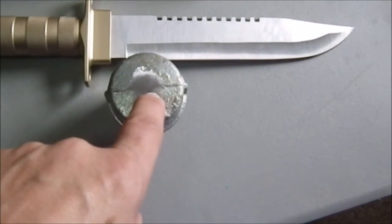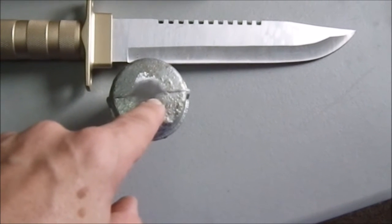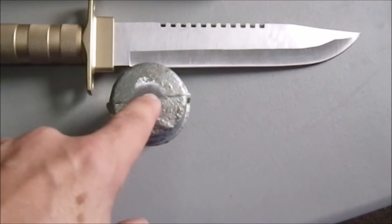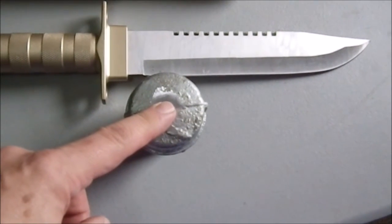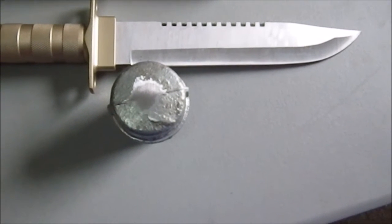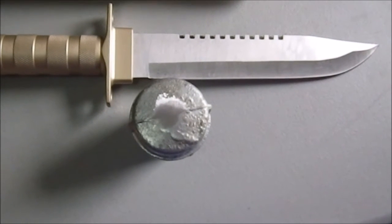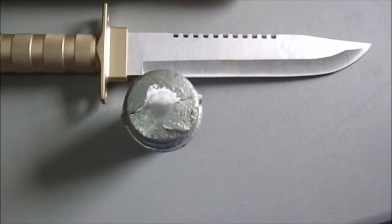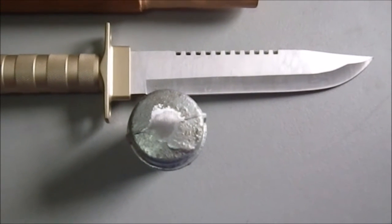I'm going to drill a hole about the size of a standard wood screw — I'm using square drive screws. Once I get that drilled, I'll probably chamfer it a little bit because it's got a fluted shaft, so I'm going to have a place for that to sit. Then I'm going to use one that's got a square shoulder to make it flush, make it sit on top. I'll see what I've got in my toolbox.